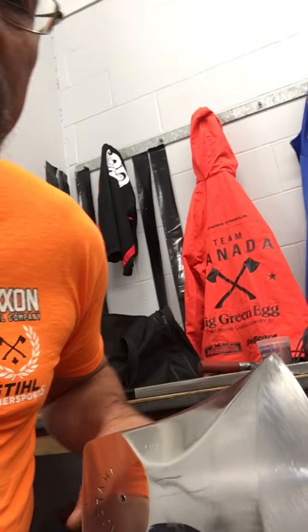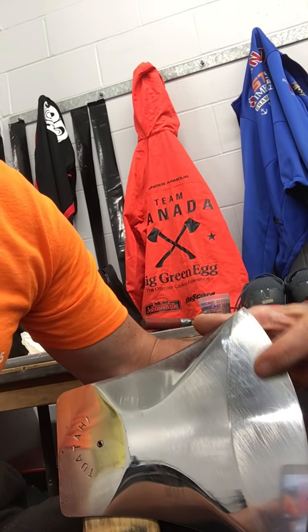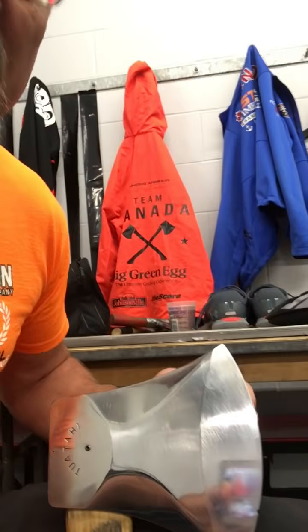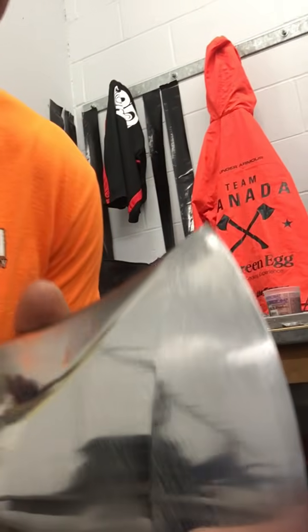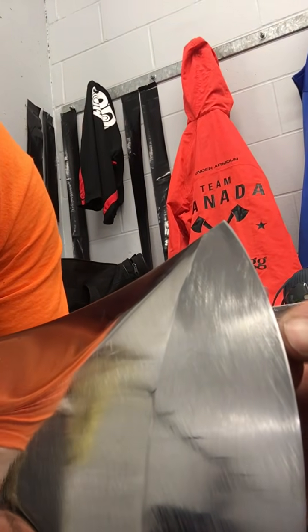And then all of our axes, out on the very end of these, once we have the basic grind, this is banana, it's ground out to here. My chisels are ground from the 3/4 of an inch out to the edge, or 1/4, whatever it is. But then on the very end, if you look really closely at this axe, you can see out here, there's a 1 millimeter, another little bevel, a micro bevel on the very edge.